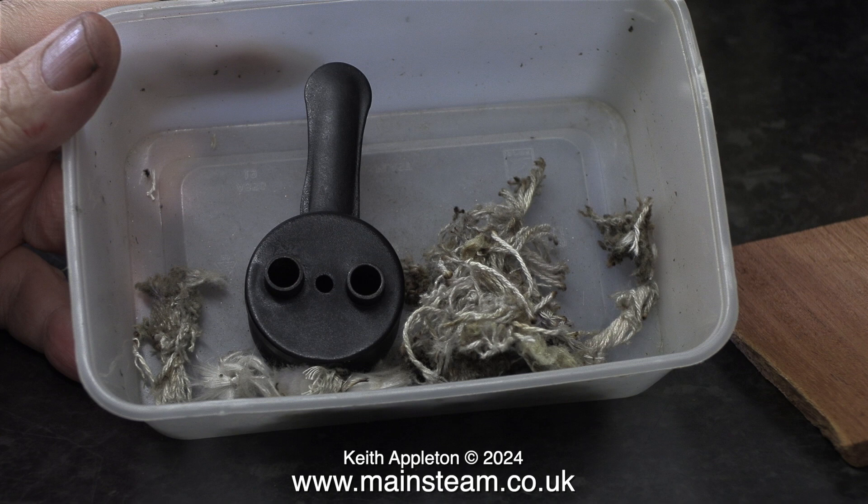In this clip I'm showing all the wick material that is removed from inside the burner. All this wick material — or at least cotton wool — has to be inside the burner. You can't just have a tank full of meths with a flame on top of it, as the methylated spirit would just burn and boil over and then you have a problem — it becomes very important to put out the raging inferno all over your bench.